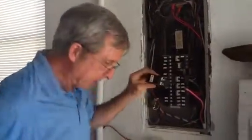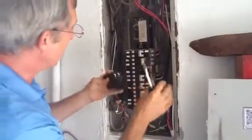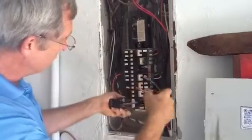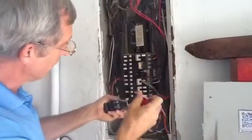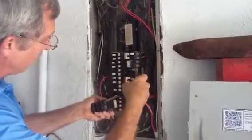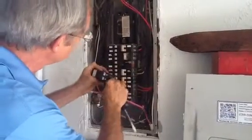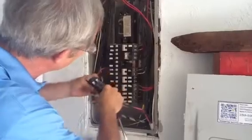I'm going to demonstrate today how to put this in. We are actually putting a condenser outside, and it's a higher efficient condenser. So we had to go from a 40 amp breaker, which is what this wire is rated for — it's 40 amp, it's number 8 copper. We're going to go to a max of 30, but I actually have a 25, and the code says between 18 and 30, so we're going to go with 25 on this one.